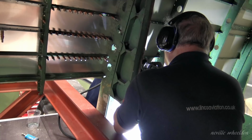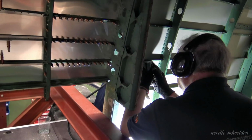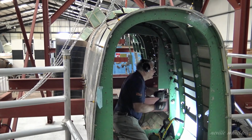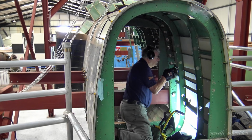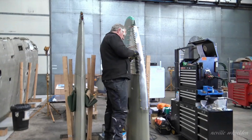This shot is of the inside of the rear fuselage, KB976. Les and Ian are riveting the end skin to the structure. Theirs is the lighter coloured skin. The one with the skin pins is the one Phil was working on. If you remember, this one had fire damage. Les is inside the fuselage with the reaction block, while Ian is outside with a rivet gun. Keith's on the final fit before painting.